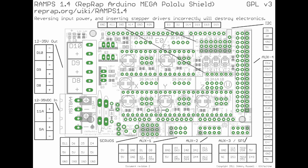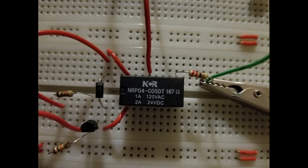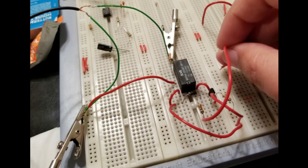I'm not sure I needed to do that but it works. The next step was to design a circuit that would take the signal from the printer and apply 240 ohms across the two wires of a headphone plug as needed. I'm using a small relay in order to isolate the printer from my phone — I didn't want to run the risk of one device killing the other.